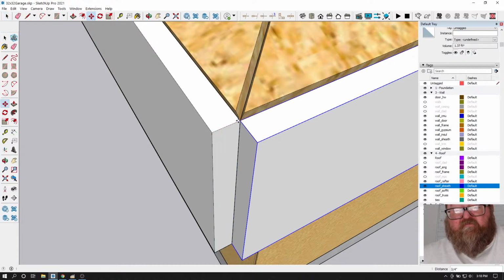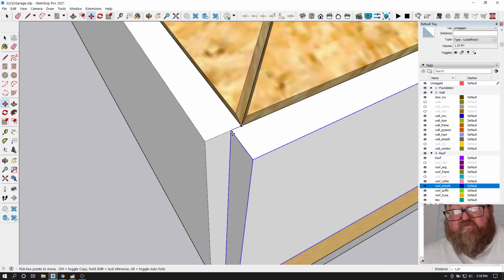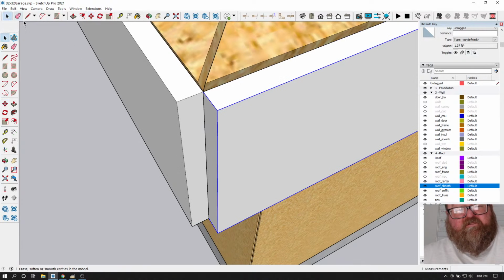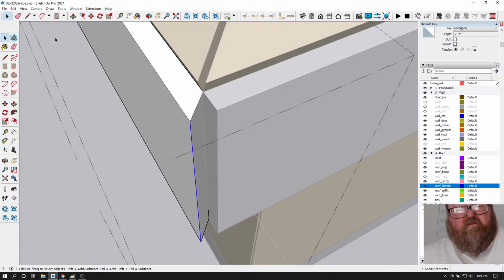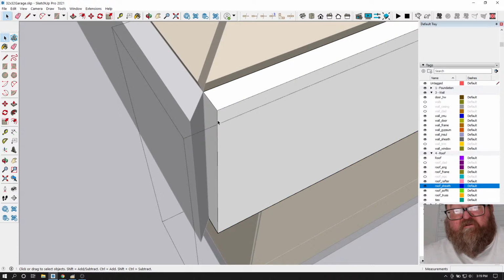Now what I do is I miter these fascias. I know a lot of carpenters don't do this, but I'm going to teach you some quality right now, Mr. Carpenters out there. Just take your high dollar miter saw and bring this out. It makes your corners look so much better when you miter them.